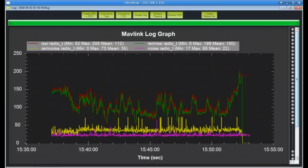For those curious about the performance of these telemetry modules, I don't have a lot of data yet and haven't flown too far because the plane is hard to see at distance. But from the telemetry log, the difference between the RSSI lines and the noise lines shows connection quality — when the signal is well above the noise you have a good link, and when they come close you're nearly losing connection. It has gone down to about 50 at a few points — when the plane was furthest away and also turning, putting the antenna null point toward the ground station.